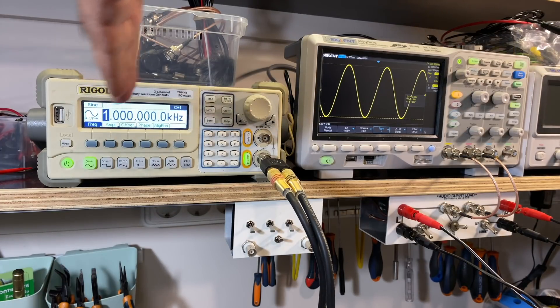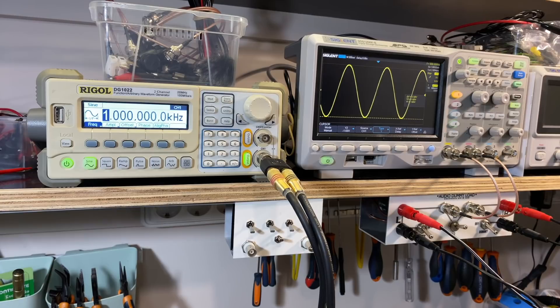I wonder what it's like at the bottom end. There's our 1 kilohertz - let's go down. 100 hertz, 10 hertz, and this thing is still showing the whole band. 3 hertz - it's flat right across the band. And this thing has got a capacitor on the input - I don't understand it. It must have a very high input impedance. The impedance is actually the volume part, which is still active. Fantastic as a lab amplifier - it's giving us basically a flat response all the way from near DC to broadcast band.